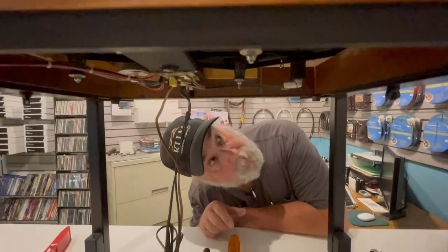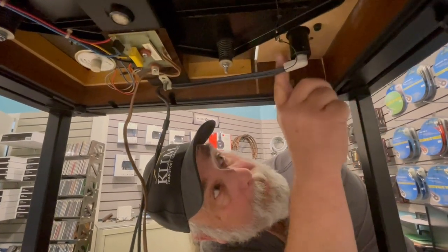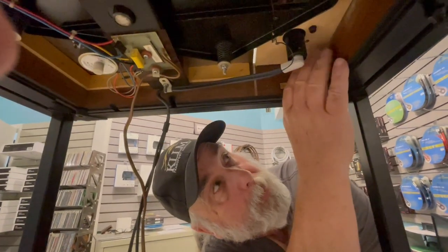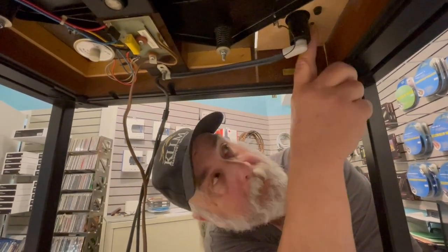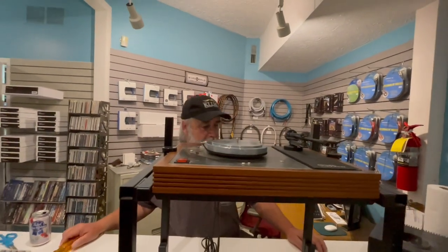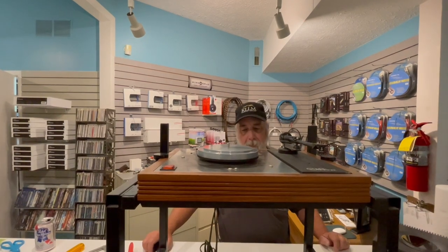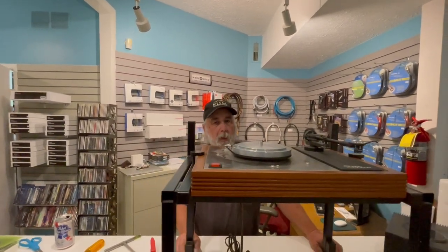When you're dealing with these older boards, whether the screws are really properly holding it is questionable, and whether the bolts holding it to the armboard have proper tension is pretty doubtful. The step from here was a dual laminated board, and you wanted it tight just before you cracked the lamination on the bottom side. So there's this running story: there's tighten, then there's Linn-tighten, then there's broke. While some people consider the Linn LP12 a pain in the ass in terms of what you need to do, I appreciate all the thought that went into it and why you do the things you do.